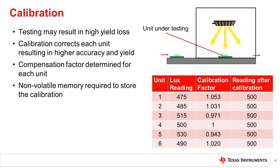Testing on the production line allows the error of each unit to be measured and allows rejection of units outside of an acceptable error. This limits the maximum accuracy achievable and may also result in high yield loss depending on accuracy required and variation seen, as failing units are scrapped. Performing calibration on each unit will correct for this error rather than rejecting the units, improving the yield. It will also allow good units to be corrected. As the light level shining onto the sensor is known, this can be used to determine the compensation factor and write it into each unit.